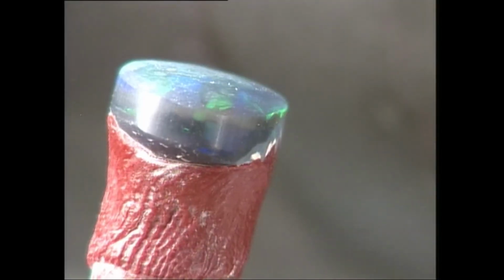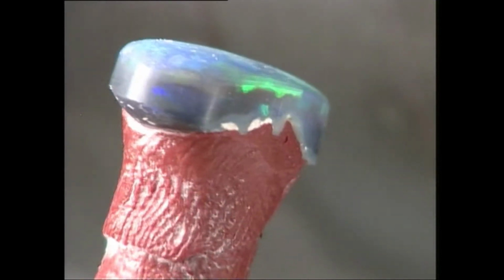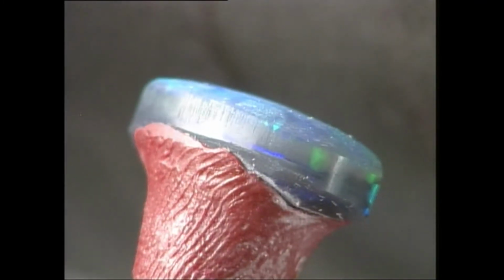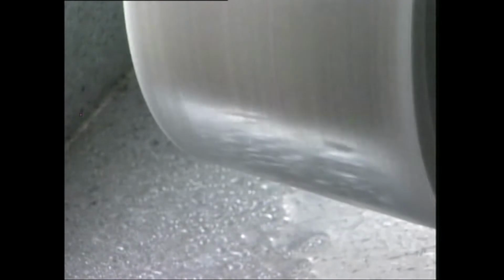And we'll just have a close look. We have a satin finish on the end here. That's the desired effect. Looking up the side of the stone here, on the setting edge itself, these vertical lines have to be gotten rid of, the remnants of the wheel marks from the previous operation. Again, working at the same angle, work the long sides more than you would the shorter.